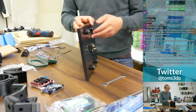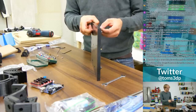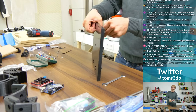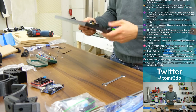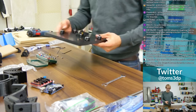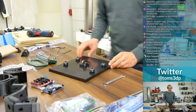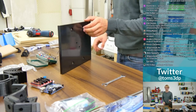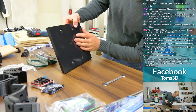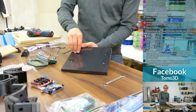Like carbon fiber, again, I wouldn't want to mill that. It's more of a grinding through it, really, because you're not really cutting it. You can cut the resin, but you can't really cut the fiber, so you're slowly grinding through it, which again just creates a whole lot of dust that you don't want to have floating around.